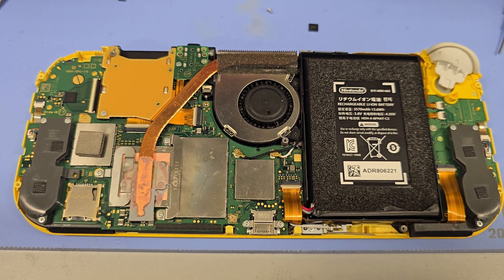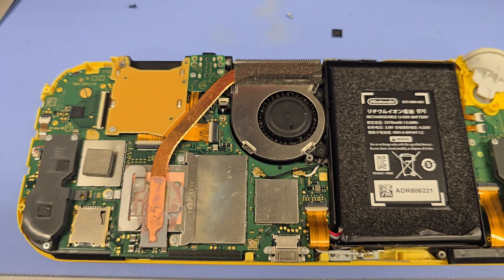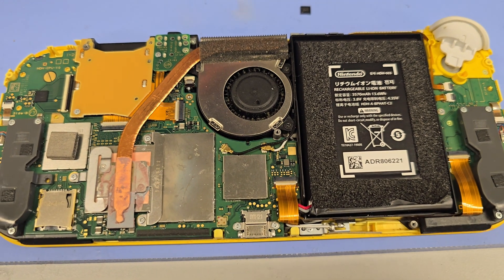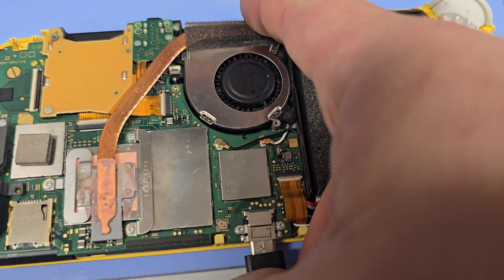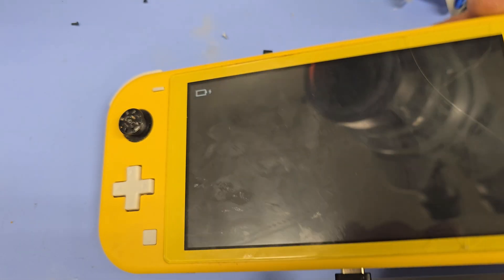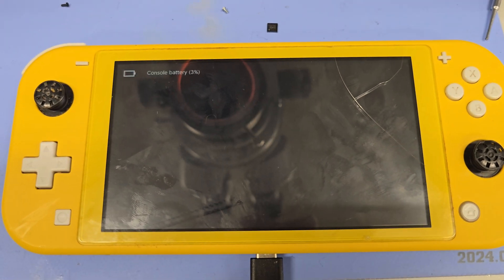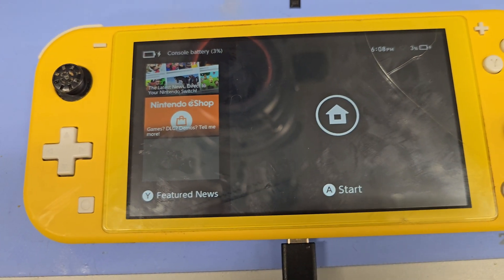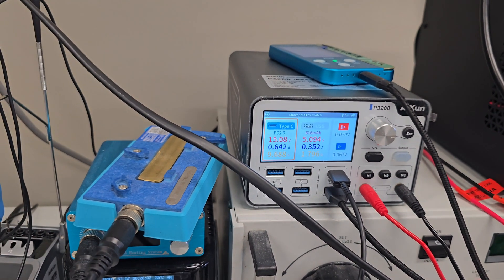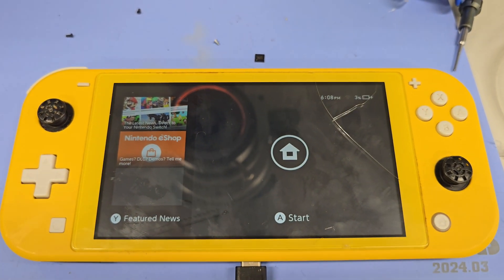Went ahead and installed the board back into the chassis. I have some screws missing because I'm going to take the heat sink back off to change the thermal paste, and also clean the fan while I'm at it. I also gave it a new charger port since the old one was loose — easy enough to do. The device turned on all the way, and there you go — it is charging again. Right now it's slow charging, but after a while it should pick up to about an amp and a half. She is working — I'm quite happy.